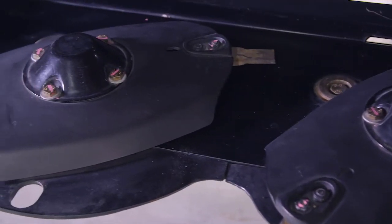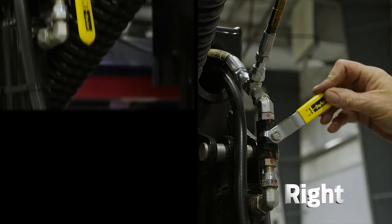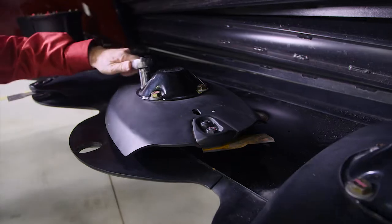To replace a damaged shear pin on a disc drive spindle, raise the header and park on a level surface. Shut the engine off and engage the cylinder safety lockout valves. Open the cutter bar doors and clean debris from the work area.